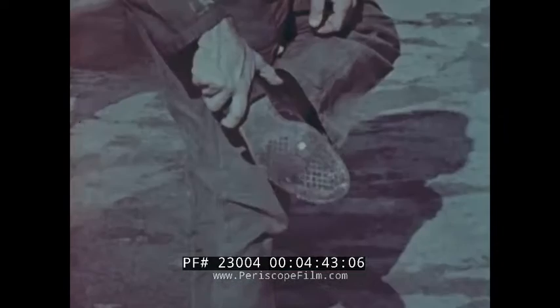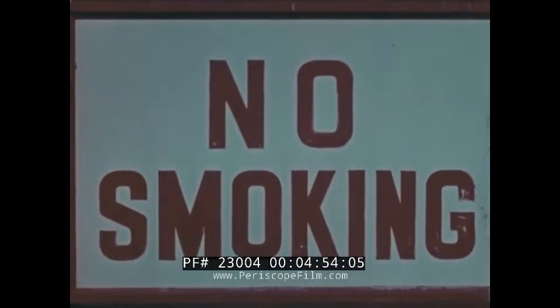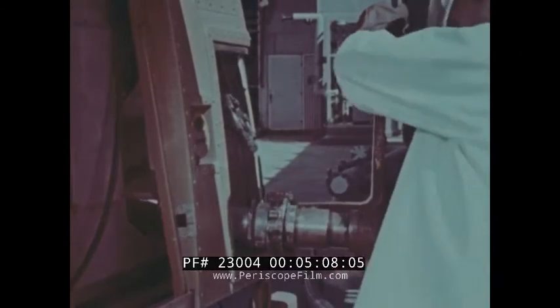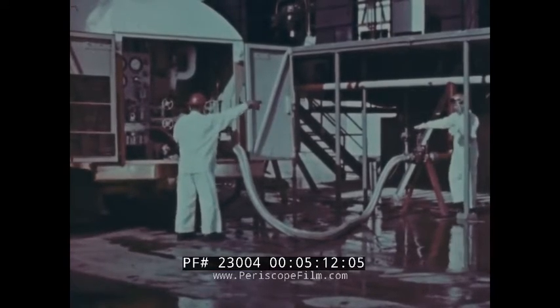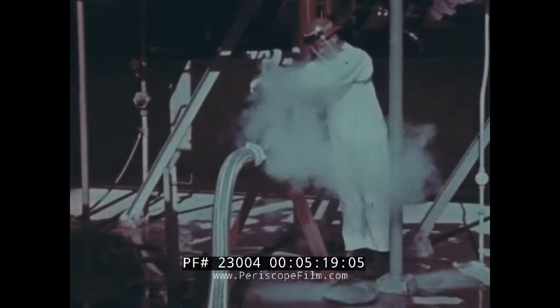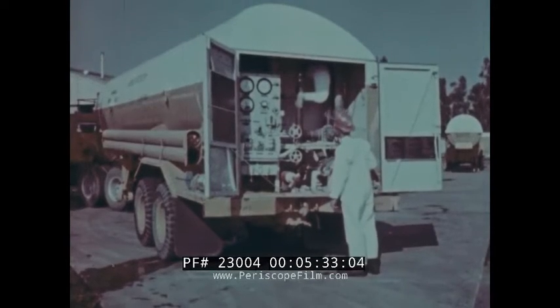Check your shoes or boots for metal particles or other organic material before entering. Remember, no smoking is the rule here. Strike no matches. Use no lighters in this area. Use only appropriate tools in turning LOX fittings and connecting transfer hoses. Whenever LOX is being transferred, sufficient water must be running through the area so that should any LOX leak or spill, it will be immediately washed away. A continual alertness for leaks or ruptures of all LOX lines must be maintained.